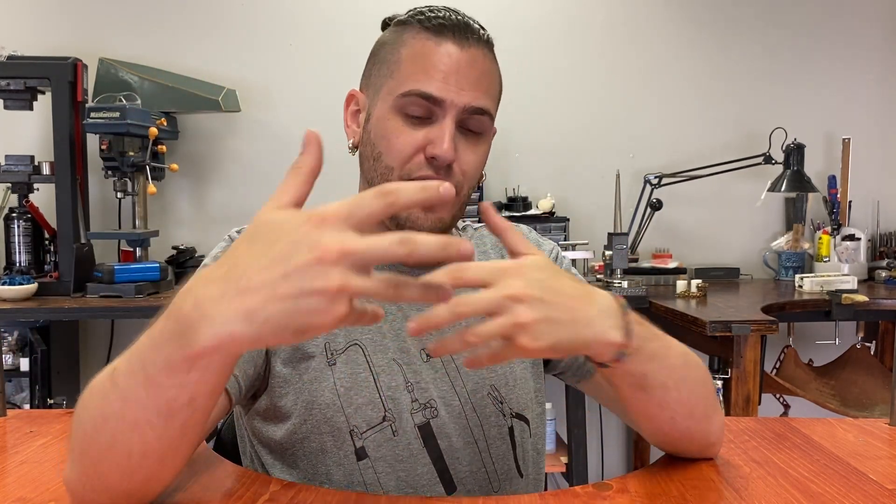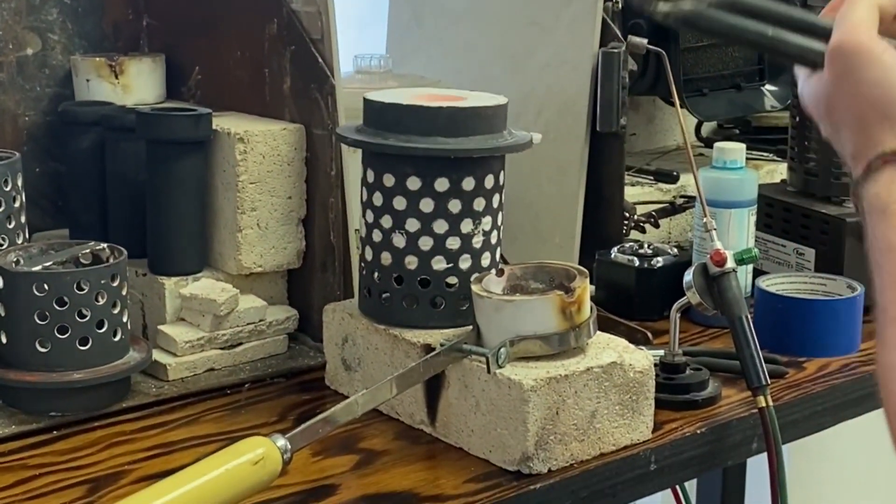So after you have poured the metal, you do need to allow it to cool. What I like to do — if it's bronze, it actually stays fluid for a little bit longer. If you shake the table or something, you might see it kind of rolling around on top of the flask while it's under vacuum. Let it solidify until the button just stays hard, then let the vacuum off, take the flask out and allow it to cool for about 10 minutes or until the button goes black, at which point you may want to quench your flask into water. Generally speaking, when you quench a hot flask, the investment will get blasted off of the casting because it's still hot inside — the water boils, it steams, it's blowing it away. There will still be a little bit of residue, but for the most part it won't be a brick that you're going to be dealing with. If you let it cool all the way, it will be a brick and you'll have to use manual force with a hammer or a pressure washer, whatever works for you.